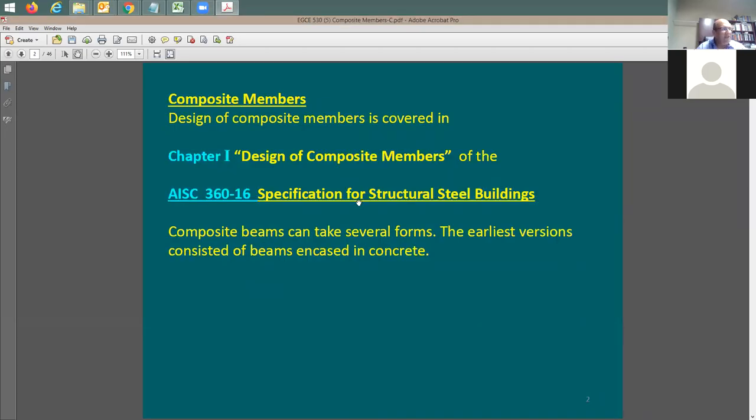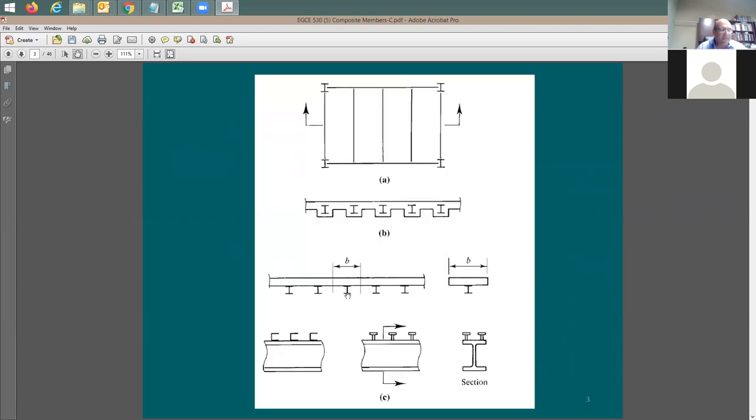Composite beams - Chapter I - it's not just for steel beams, it's going to be also for columns and other sections, but here I'm more interested in W sections. When you have a concrete beam supporting it, the spacing from beam to beam is equal to b, from central beam to central beam. If you consider a slab width - which is the compression flange - this is also equal to b. So as if I cut this piece from that location to that location and take it out to start my analysis.